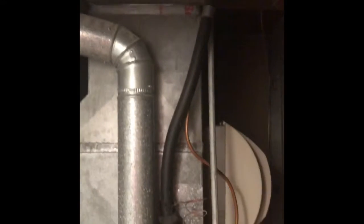We'll flush and pressure test the refrigerant lines. We're potentially going to do a new humidifier — it's got a condensate pump on it now, so we're going to put a new condensate pump on it. We're going to run new vinyl up to the ceiling — it'll have to come across the ceiling, so we'll take a couple of these ceiling tiles out. It runs through this one right here next to the light, then across and through the wall right above that cabinet — that's where the vinyl tubing runs into the drain. They'd like that replaced in PVC.